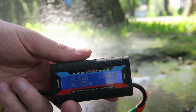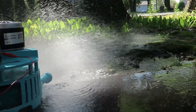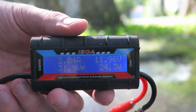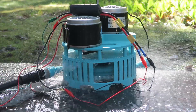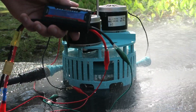Now that the camera is focused, you can see there's a 2.3 or 2.4 watt draw on the motor. That shouldn't be happening because there's currently no load on it, so I think there's a flaw with the motor — some resistance on the inside or a flaw in the system that I need to address. The motor is making about 19 volts. Now with the resistive heater connected, it's making about 25 watts at about 12 volts. That's actually a decrease from the last video, likely due to the second motor being on here — even without an active load, there's still that free-spinning torque drag, and this increases with motor resistance.